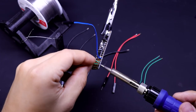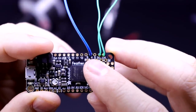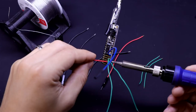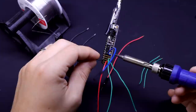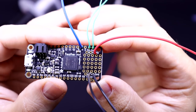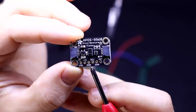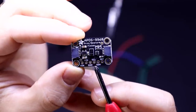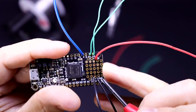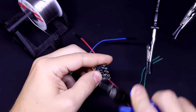The blue wire is attached to pin 6 on the feather board, and the longer green ones are attached to SCL and SDA. These are used in the I2C protocol, which is what it uses to talk to the gesture sensor, so the other end of these will go to that. Next, attach the female ground and power wires. Now on the gesture sensor we've got pin holes for power and ground, and we'll use the male jumper wires for those. SCL and SDA again will lead to the corresponding pins on the feather. Notice that I'm attaching the wires on the bottom side of this board — it makes it a little bit easier to fit in the printed shell.